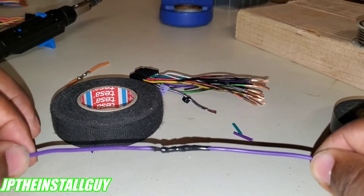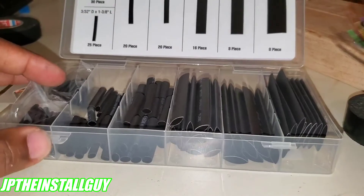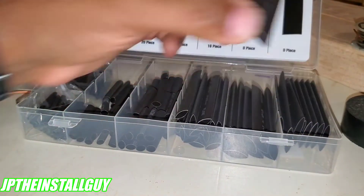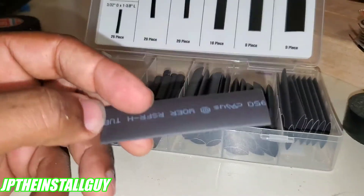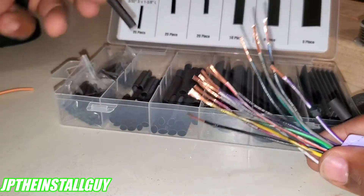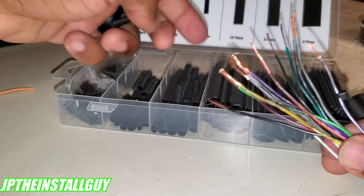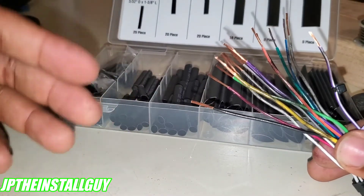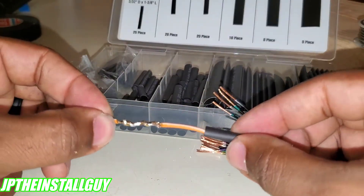Or you can use the better way and actually use heat shrink. This right here is a sorted set of heat shrink — I'll put all the links in the description. You want to get the best heat shrink size to match what you're doing. You wouldn't want to use a large piece for a single wire because even shrinking to half its size it still won't be tight enough. Go down to something like 5/32 or 3/16. Take into consideration that you're going to be twisting two wires together and soldering them, so it'll be a little bulky.